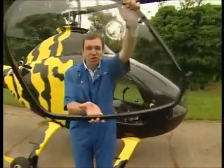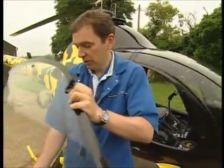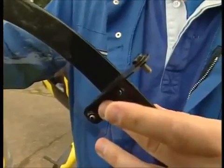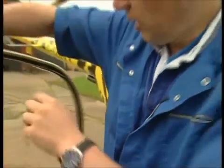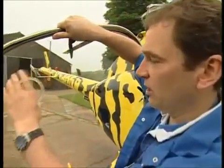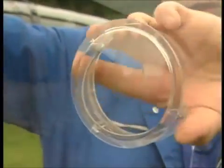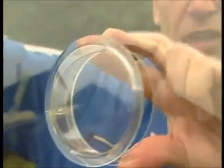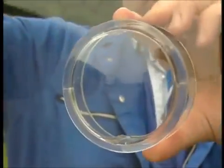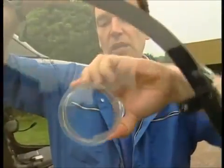Take a look at the passenger's escape hatch - completely finished now, looks brilliant, all painted up the same black as the front of the helicopter. The additional things added are the hinge brackets, which come as flat bits of metal in the kit that you bend to shape, and the latches. There's also a great air vent - very simple engineering. Give it a squeeze and turn it to whatever position you want: turn it to the front for maximum airflow, face it to the back for less, pull it in to reduce the hole size, or shut it completely.